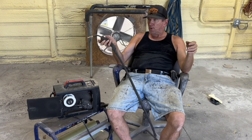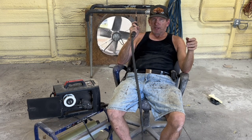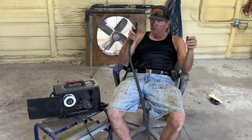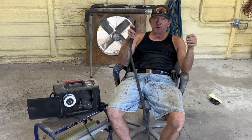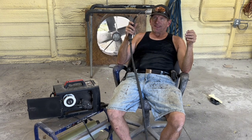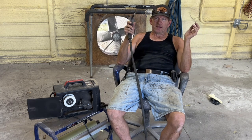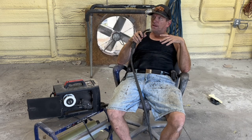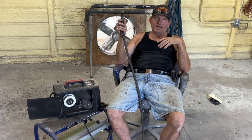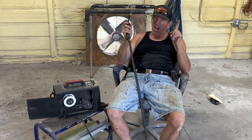So the tutorial I give for welding sheet metal, I'll start with automotive sheet metal, and along the way, I'll cover the welding of super thin sheet metal like you've seen me weld in 26 gauge, because that requires a completely different approach than welding the thicker metal. And when you jump from sheet metal to thicker metal, after I teach you to weld sheet metal, you're not going to need the lesson on welding thicker metal. It's easy to weld thick metal. You start welding. Not true with a MIG welder.